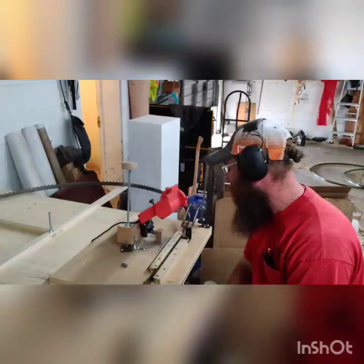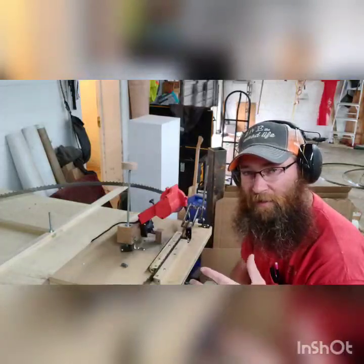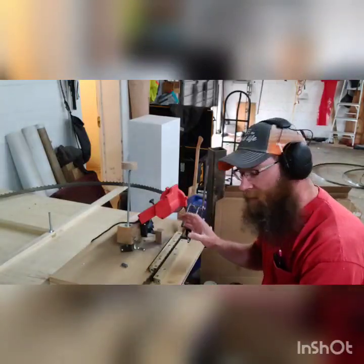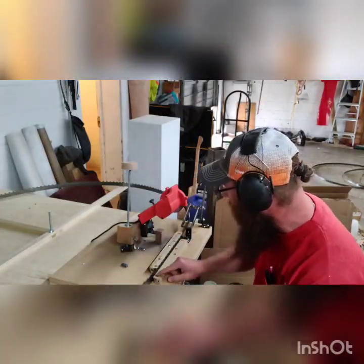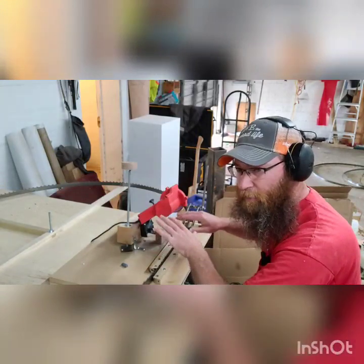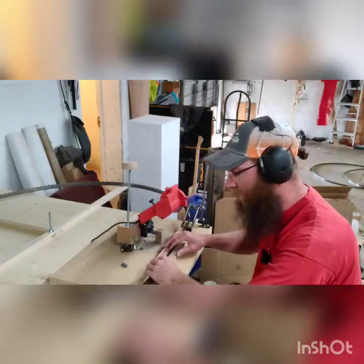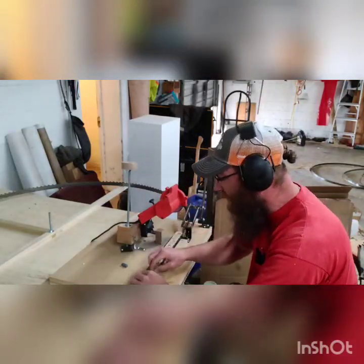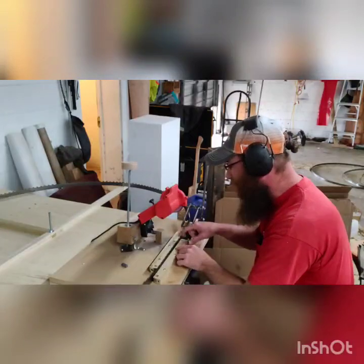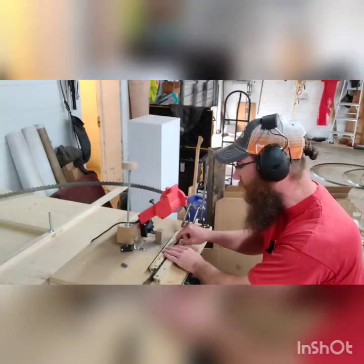So they work really well. I haven't actually had to swap them since I started running diesel instead of water, Pine-Sol, and dish soap. So that's great. So I have a bunch of extras. So in here, we have bearings on both pieces. They're slightly offset from one another so that I can fit blades down in there nice and snugly. They move, but it holds them quite well. Out here, there's wobble, but where the grinding wheel comes down and contacts the blade, there are essentially 3 bearings that are holding that in place, and so it doesn't wiggle back and forth at all.